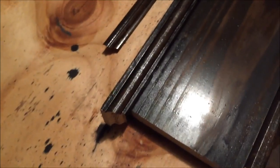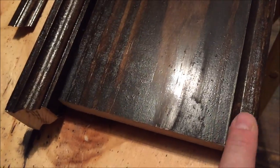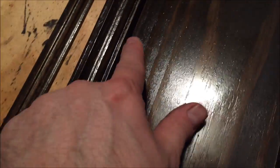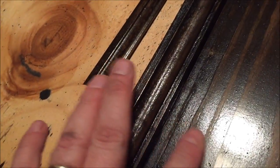I need to wipe the glue off there. But I'm fixing to put the small piece of trim on this piece right now. You can see there's that piece I routed out. It's just nailed to the top of this with some glue. Put some glue on both of them just to make sure they hold up. And then I'm going to put that little trim piece right here underneath there, and it makes such a difference transitioning between this rounded piece down to that flat piece.